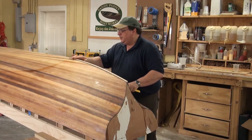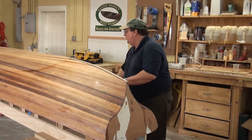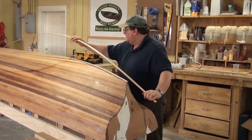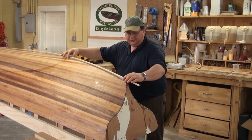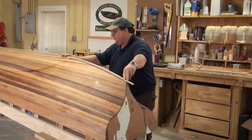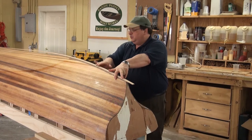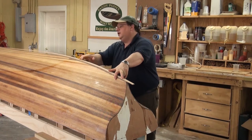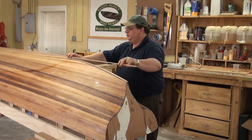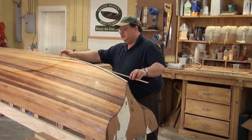Now I'll take a little bit of sandpaper and get rid of some of this gunk up by the junction, because the next step is we're going to start to put our keel on, and that's going to require us to go from here right on up. A nice smooth transition on this boat. Depending on which model you're working on, you may have to put one piece up to here and then another one past that. On this particular boat we have a nice smooth transition from the skeg bed right to the hull.